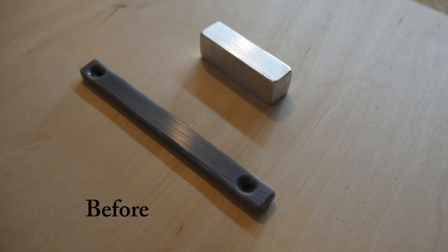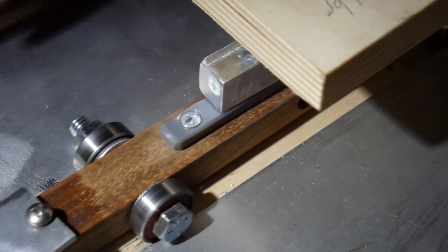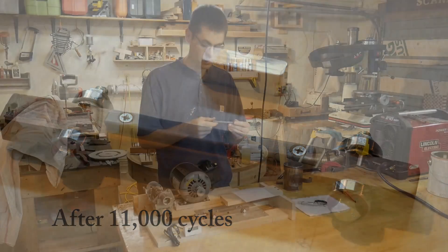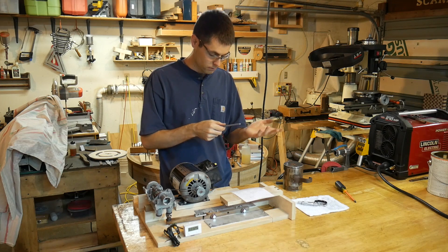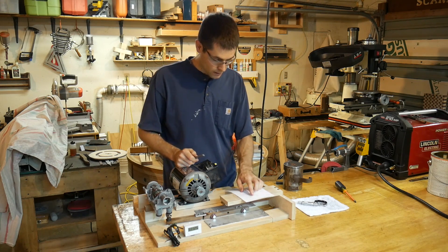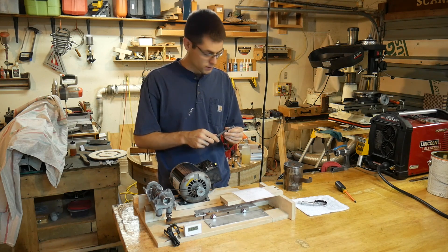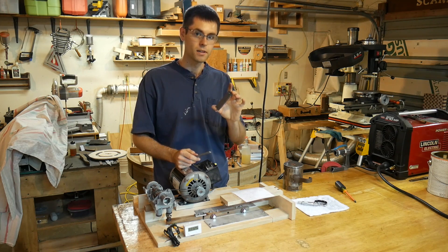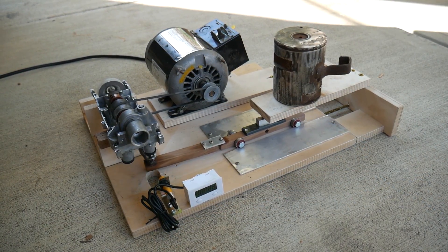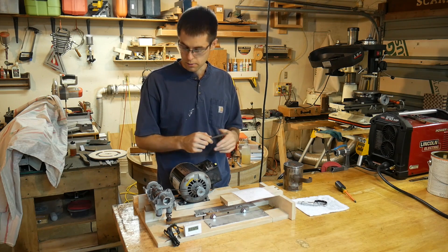The second one that I did was this UHMW plastic, which is a little bit softer and more flexible, but it did fare a little bit better, even though the other one did great. You can't really tell the difference between which side had the wear and which side was facing down, aside from the fact that the up side is slightly dirtier. It still has all the striations from being cut. I did actually get that it was three tenths smaller, but it turned to night while I was doing this test, so I think you may chalk that up to temperature. That one had 11,000 cycles and practically no difference. One benefit the UHMW had over the MDS Nylon was that at about 6,000 cycles the MDS Nylon started to squeak slightly, whereas the UHMW was exactly the same the entire time as far as sound and all other characteristics.